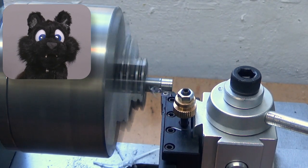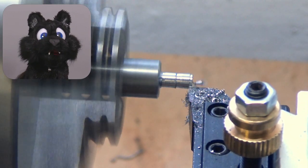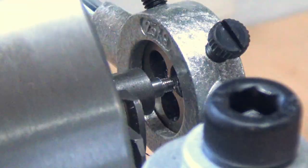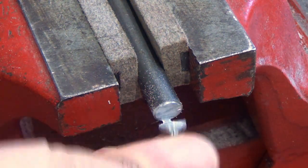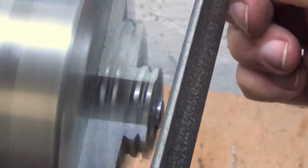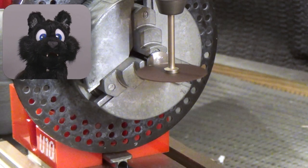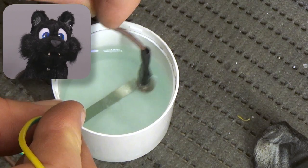The neck strap needed a new screw. I decided to give my lathe a run and made not one but two new screws. The thread in the case was worn out and called for a slightly bigger screw, and to match both sides I just made my own version. Cutting the slot for the screwdriver required me to throw together an improvised holder in my model-making mill and a Dremel cutting disc — but it worked! I also gave them a hint of nickel plating.